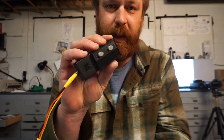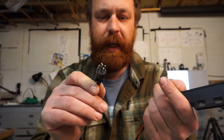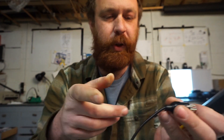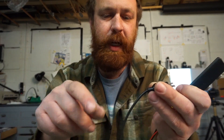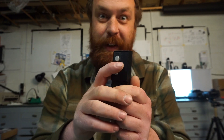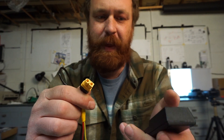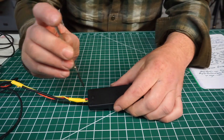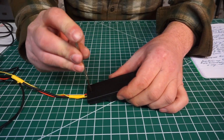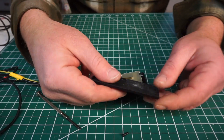Now I'm going to show you how to wire in a remote so the boop boop can trigger your projector. You can take the remote cord for whatever projector you have — the way it advances is it connects the center pin to one of the side pins — so you could cut the wire, figure out which two wires trigger the advance, and wire that in. But I wanted to preserve my remote for slideshows later, so I took it apart and added a pigtail with the XT60 connector.